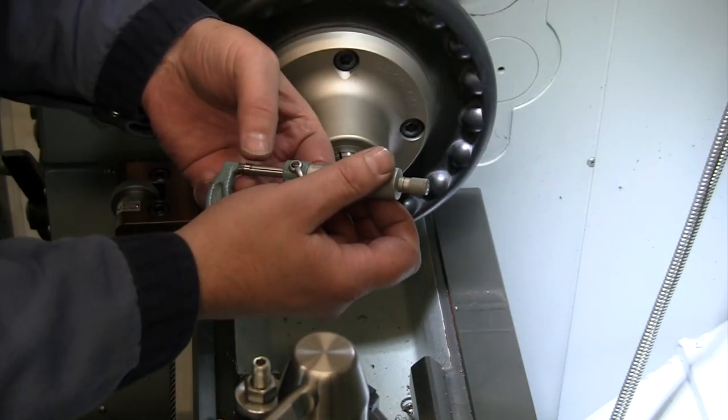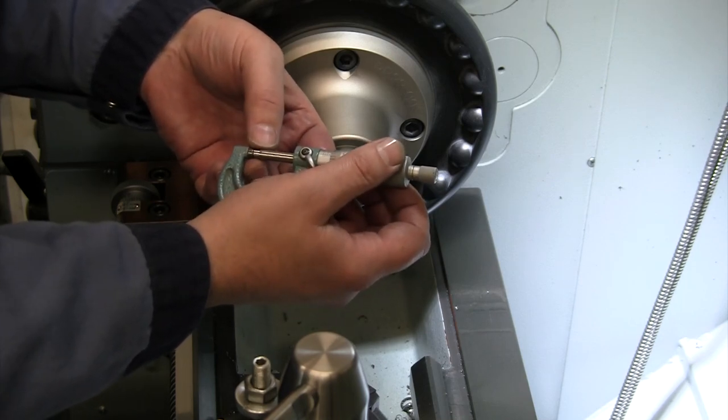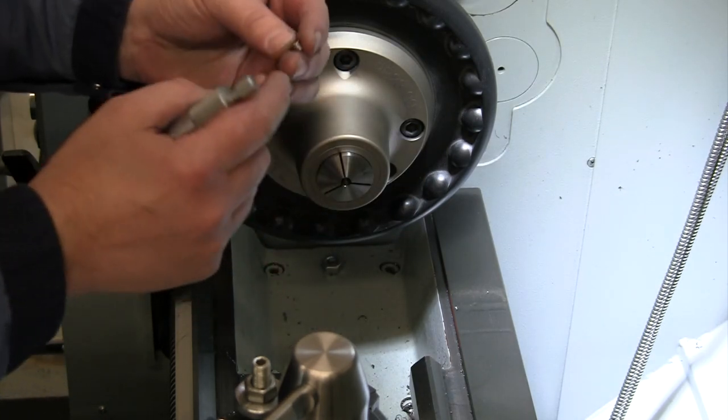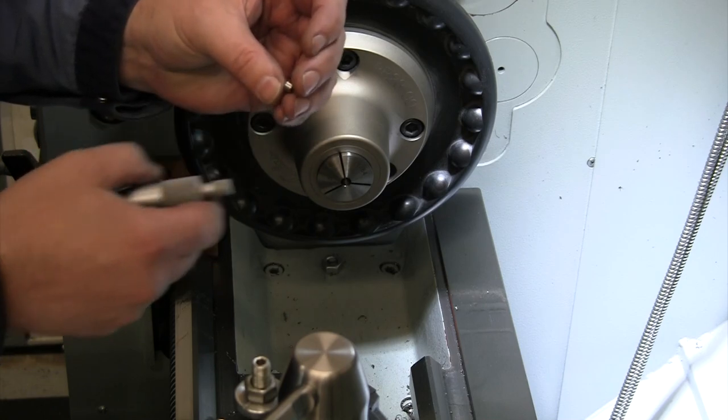All right, this was the first one. This one's a couple thou, about a thou and a half narrower than the other two, but that's all right for our spacers. I think we're in good shape. So we got the outsides of this bevel too. Well, you gotta love a collet chuck for being able to grab onto little tiny stuff and still be able to touch it up and machine it.